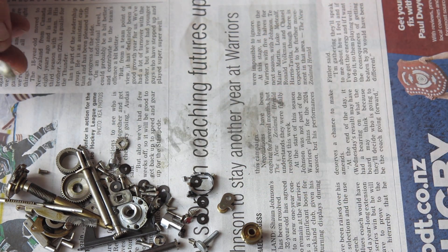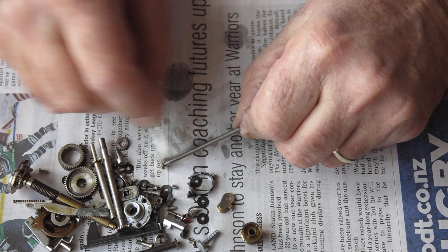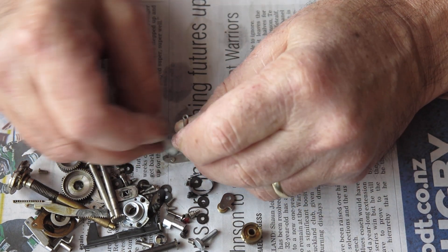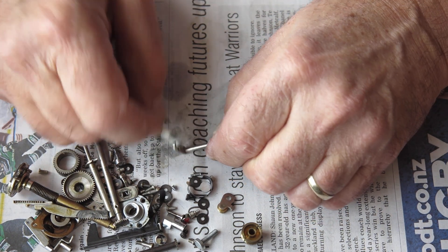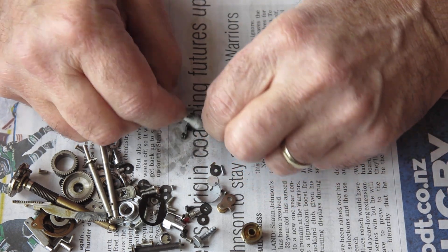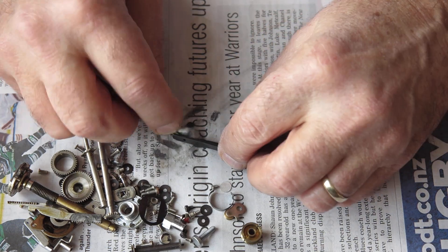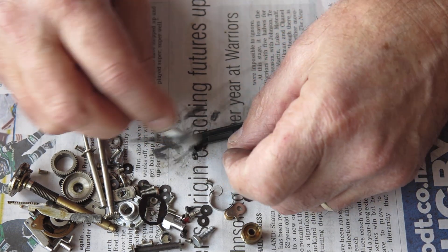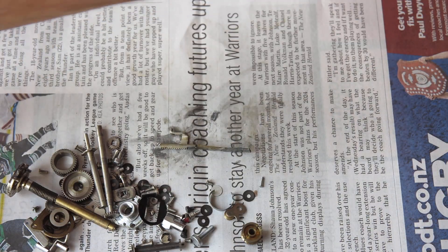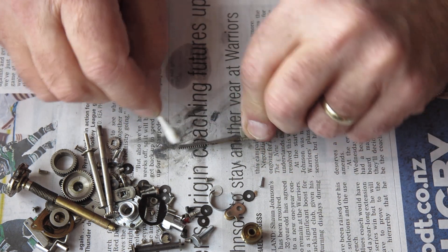This is the lock lever. Its job is to hold the film advance — stop the film advance lever from being moved when the frame counter reaches number one. The idea is to stop people reaching the end of the film and ripping the film up with the sprocket wheel. It would certainly achieve that as long as people set the frame counter correctly when they loaded their film. Once you're used to a Retina camera locking the film advance at frame number one, it's no longer any surprise — it's a feature, not a bug.